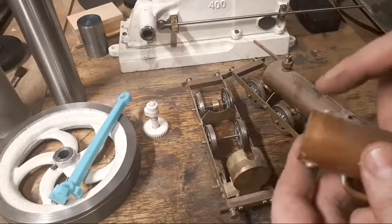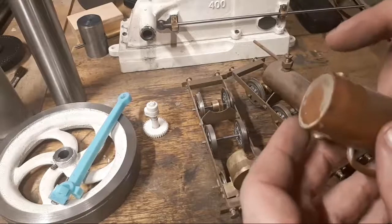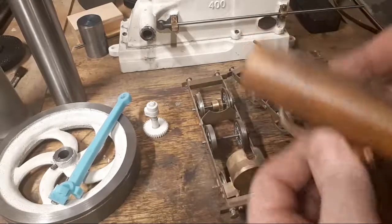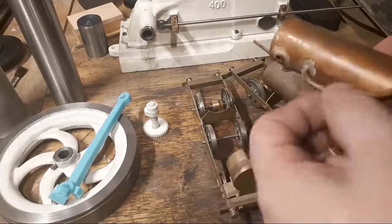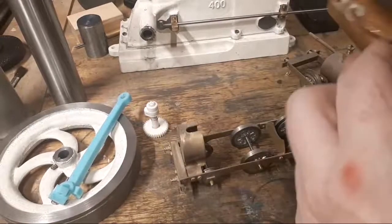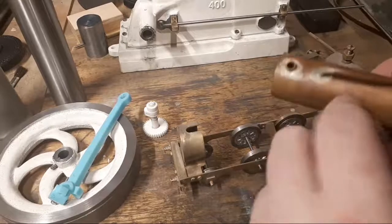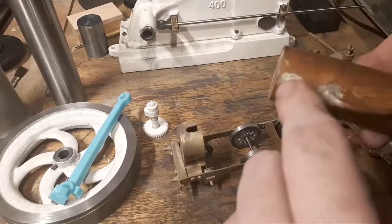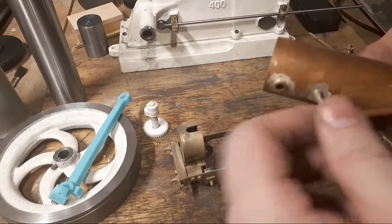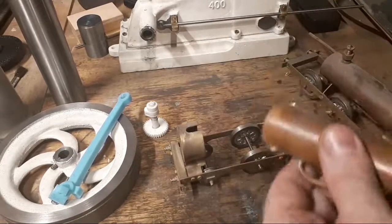Because this chimney needs to be extended as part of this pipe for the exhaust tube through the end. That's the first thing. And secondly, these pipes are much too big a diameter for this little engine, and you can't route them around between the wheel and the frame and up to the engine without running into some serious problems. So whether I drill this and this out and start again, the trouble is I'm going to have bits left inside the boiler, so I think I'm going to have to make 2 new boilers, and that's why I've been putting that off at this point.